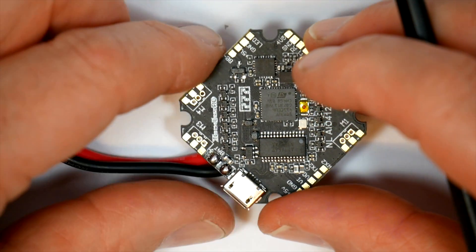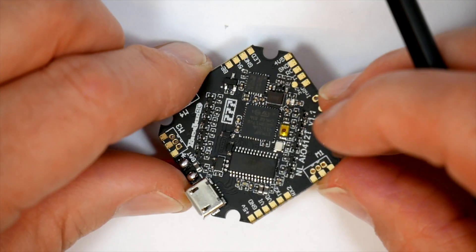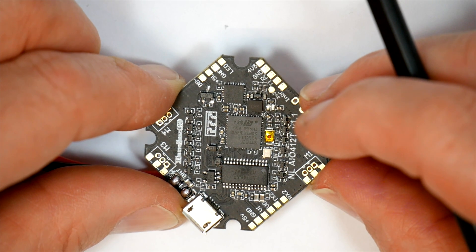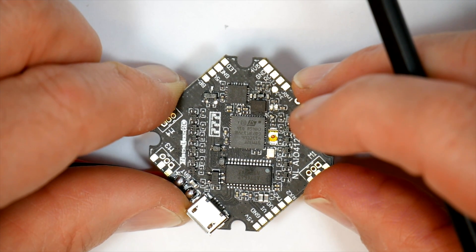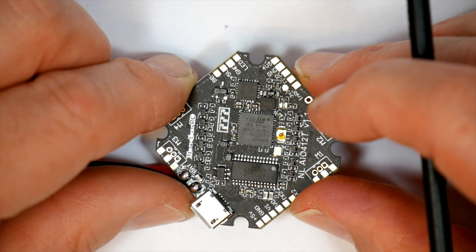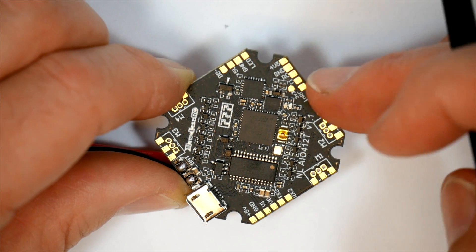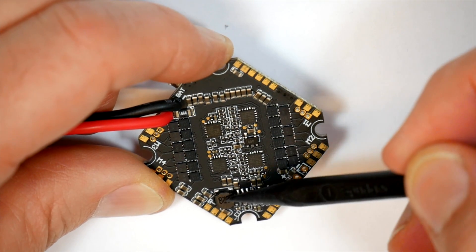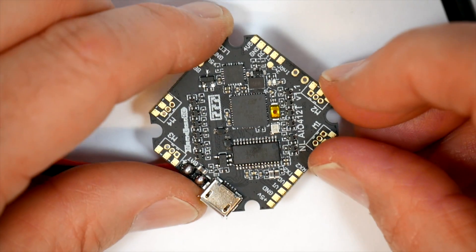All in all, this looks like an awesome replacement for the flaky CrazyBee boards and will more or less just drop in as a replacement in your existing quads. How reliable will it be? Only time will tell, but it does look very promising. I'm glad NLRC haven't tried to incorporate an onboard receiver like the CrazyBees do — that just makes things harder with more manufacturing complications, and I've never found the clone receivers are any good. Using your own receiver gives you more control over quality. I always conformally coat my flight controllers after a landing in wet grass fried my Mobula 7. On the back side we've got all the FETs and part of the buck controller. I'm really glad NLRC have released this and hopefully it'll make our quads that bit more reliable.